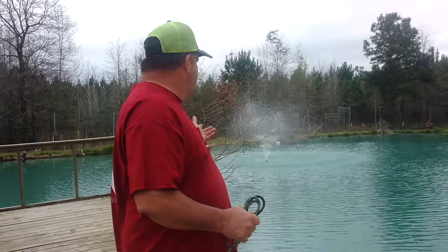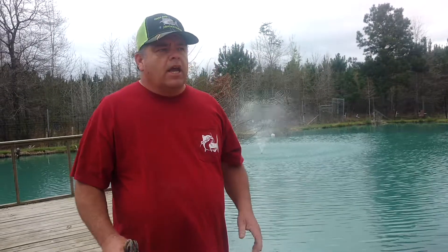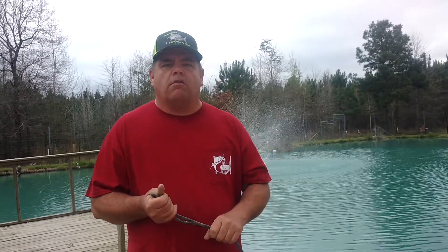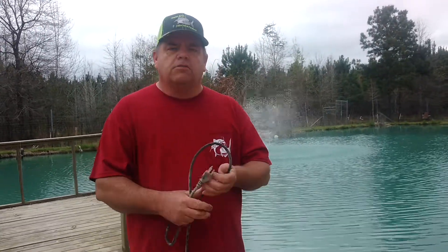When you do it this way, you always want to put a ground fault breaker — a GFCI plug — in there, just in case something happens. This setup has been going on for about three years now and I've never had a problem out of it. Not to say it can't happen, but so far it's worked real good. And even if your pump ever does go out, do basically the same thing — move back just a little bit, cut your cord, and do the exact same thing again. Every once in a while these pumps will go out, but it's real easy to fix back.